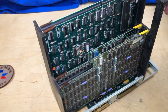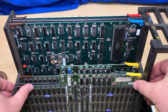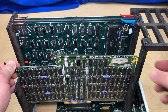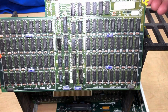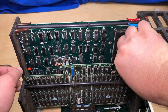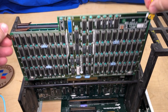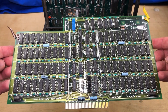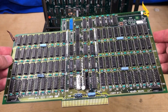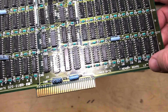This is really cool — plugged into the main motherboard are these four very large cards, labeled I/O, CPU, and M for memory. I'm going to leave the CPU and I/O cards in, but we can pull the RAM cards. They have levers at either side — just lift them up and they lift right out. There's the memory card — this is apparently 512K. Nine chips in each bank with a parity bit for each one, upper byte and lower byte.